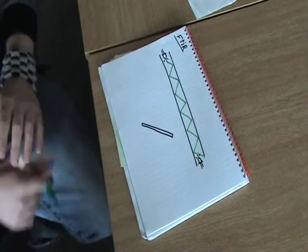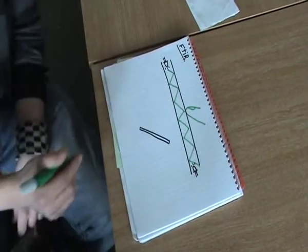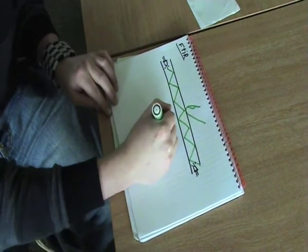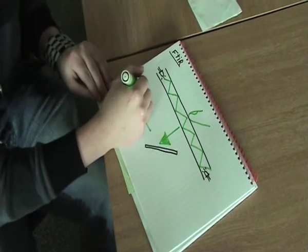So the light's trapped. Once finger pressure is applied to the surface of it, it upsets the balance of the total internal reflection, which allows light then to escape through the bottom of the pad, which is reflected off a mirror and picked up by an infrared camera.